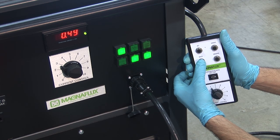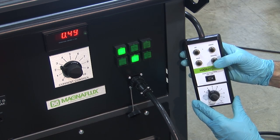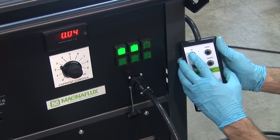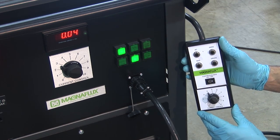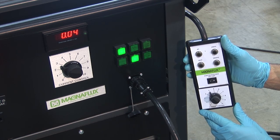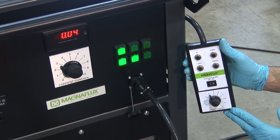The MagShot button on the pendant, when pressed, activates the current flow for as long as it is held down. The demagnetization button is to the right of it and only requires an initial momentary push to start the automatic decay of current for demag. The buttons for choosing the current type between half-wave DC and AC are at the top of the remote pendant. The only thing the remote pendant does not have is the pulse feature enable button, which is only present on the front of the power pack. However, initiation of the pulse cycle can still be done with the Mag button on the pendant. The pulse cycle can be interrupted by pressing the pulse push button on the operator interface panel.